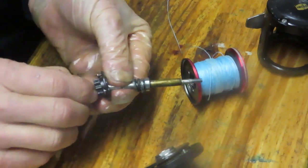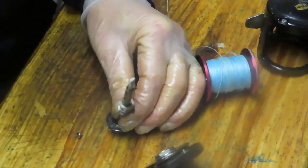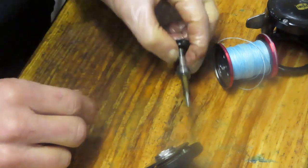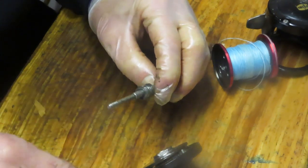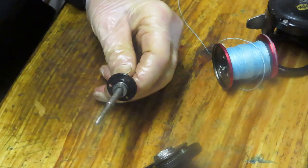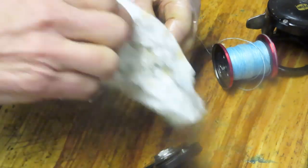There's your collar and cases with screws — knock the screws out and put them into the parts tray. I use a parts tray that segregates all pieces. As soon as you start playing around with these things, parts start falling away. Let's take that sleeve off. There are a couple of bearings in here — as long as they're running fine you don't need to do much, but on this one there's very sticky grease on the shaft that may be causing the issue.